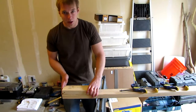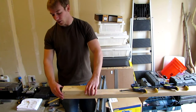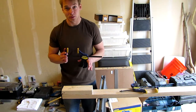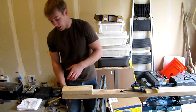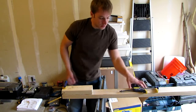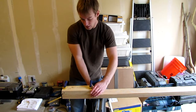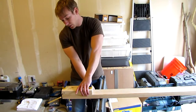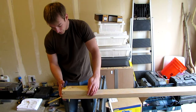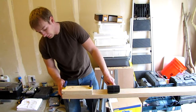This side is going to be the bottom. I take the factory edge — the one that says premium — and I line the two edges up. Then with these Irwin quick grips, which are amazing by the way, just clamp it into place on one side, then two sides. Make sure very carefully once it's clamped that this is flat. It's not quite flat, so I'm going to take a mallet and just bump it over a little bit. Perfect.